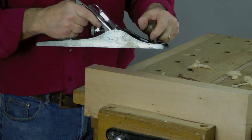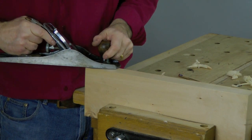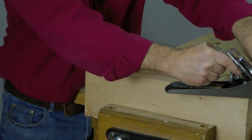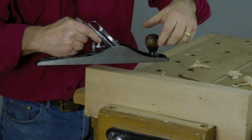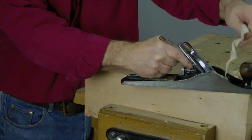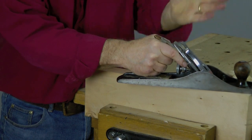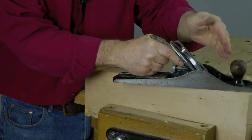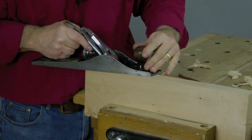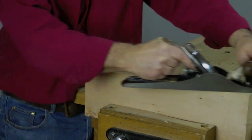I often plane at an angle — 45 degrees even. The reason I do that is it gives a big slicing cut, a bit like a carving slicing cut, and you get a very accurate, sharp shaving. So if the wood's a problem with knots or whatever, think about going at an angle like this — you get an easier cut.